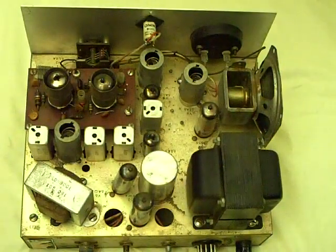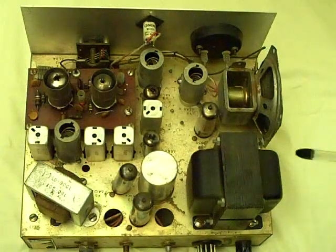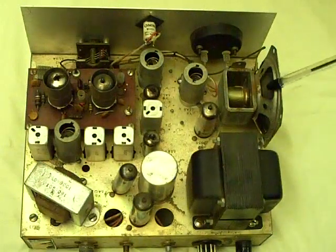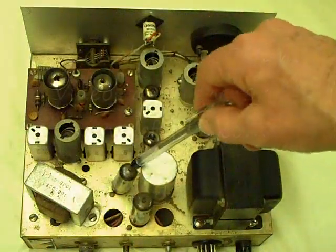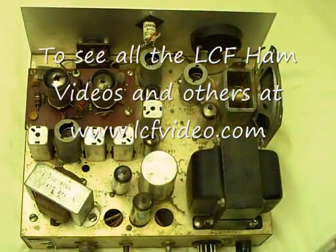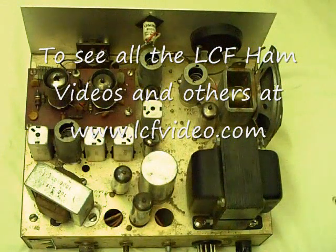Here's the inside top section of the 6-meter transceiver built in 1962. Here we see the speaker, the meter, tubes. This is a nine-tube unit. Some of the tubes have more than one function, so it has more than nine active components — but not like an integrated circuit, which may have thousands or millions of transistors.